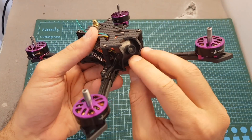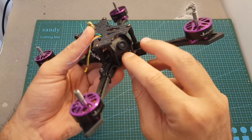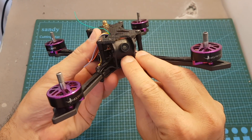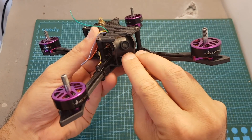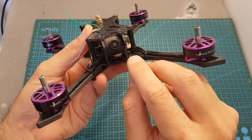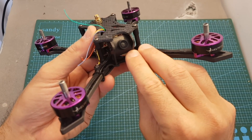On the front we can find the HLS3 11 camera, which is the oldest part in this build — everything is new except the camera. It has a 600 TV line CCD sensor, and if you want to swap it for a different camera, which will probably be very advisable, you will need a micro FPV camera with a 19x19 mm form factor.